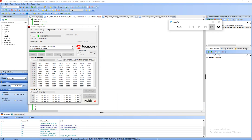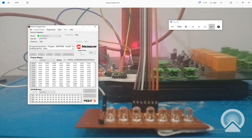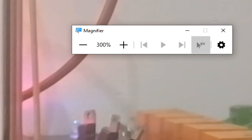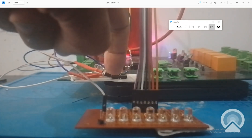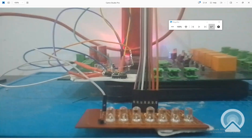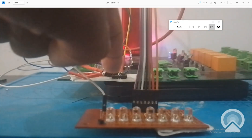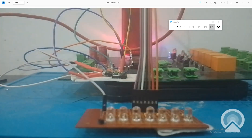The new code is burned. One button initiates the blinking and the other breaks out of the loop. I press power — nothing happens yet. I press the start button — see, the LEDs are blinking. I press the stop button — it has broken out of the loop. I press start again — blinking. I press stop — it breaks out of the loop again.